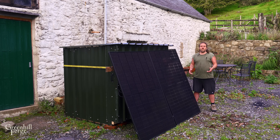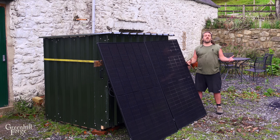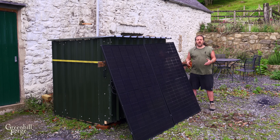Overall, I'm really pleased with how it's working so far. The UK isn't particularly known for its vast amounts of sun, so we'll see how it holds up as we get further into autumn and winter. But so far on a reasonably sunny day, I'm getting about 82°F on the inside of the kiln, which is about 20 degrees warmer than outside, and that should be drying the wood pretty well. If we get some really sunny days I expect it to get quite a bit warmer than that, and if you live somewhere really sunny, I think this thing would work really well. So I'll let this thing run for a month or so, or until the wood is nice and dried out. I'll take temperature measurements along the way and moisture readings on the wood to see how long it takes to get this wood nice and dry and ready to burn.